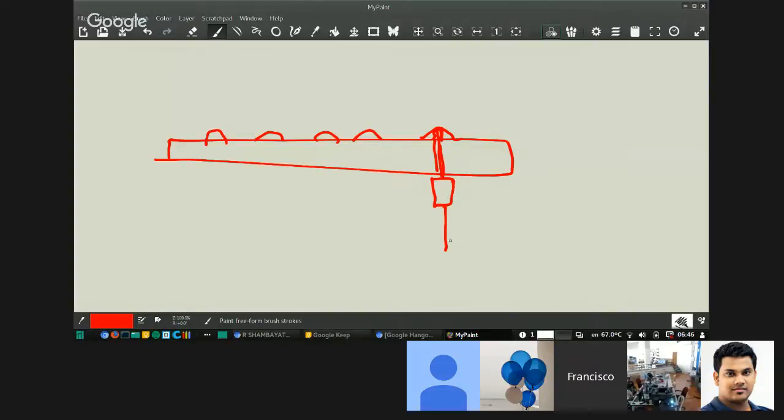I mean symmetrical because the cable here is on the other side. So if you have this VCC, ground, RX, TX, something like this, then because this is at the other side, it will be the opposite. You have to flip the cable later. And this is somewhat confusing. I recommend you just solder it like this.